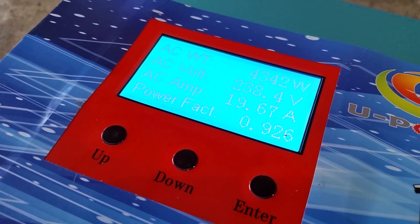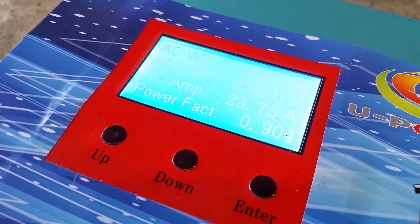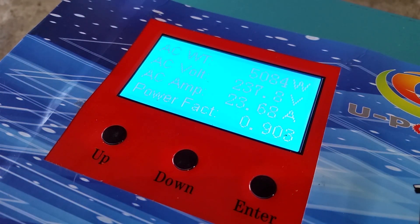I'm going at 20 amps or so again, and no alarm. Let's crank it — just go for a few minutes. 24 amps, 246 volts. There will be a voltage drop across that fuse. Down we go. Bye-bye. Good night.